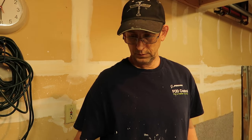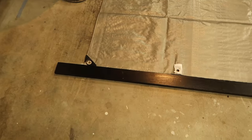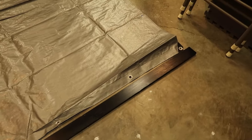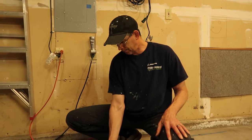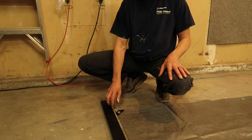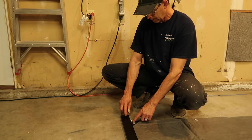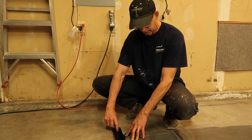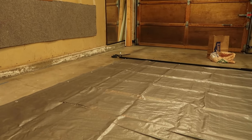So the boards are 8.5. This is just a hair over 7.5. It's a 7.5 foot tarp, but it's a couple tenths of an inch longer. I already measured this out. So I'm gonna have like 5.5 inches of place to hang stuff. So I can split that difference and I can mount my pole just outboard. So right here. And same thing on that end, the clamps that are gonna accept the ends of the pole.